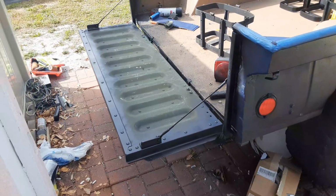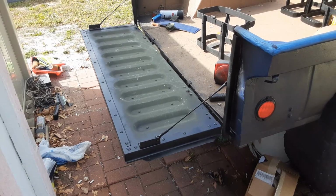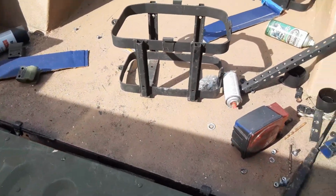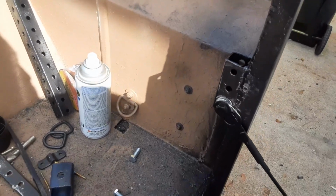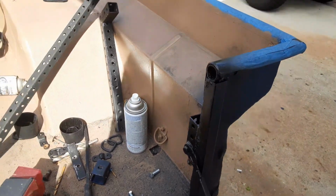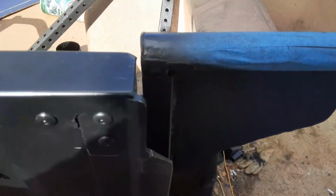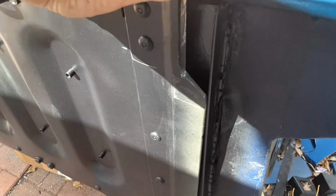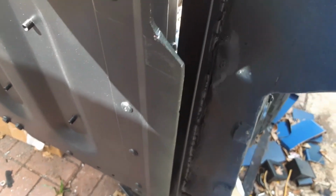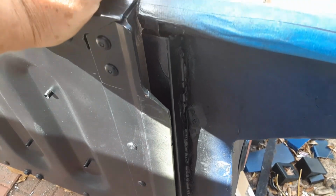Okay, as you can see, the tailgate's been installed. I've inserted a screenshot of the brackets that we used, cable tie down points, etc. So here's the finished attachment point on the inside of the trailer for the trailer to close. It's pretty light and simple. I did add a piece of square tubing right here, because of the design of this trailer. It's got that lip on the tailgate, so this gives it something more flush to sit up against.